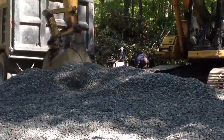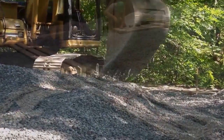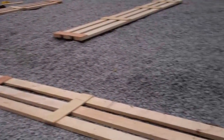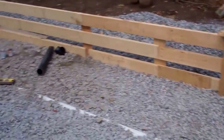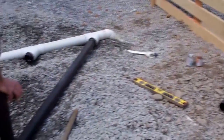Next came a layer of clean crushed stone. It's going to be in here that we're laying down all of our plumbing infrastructure. We then built forms and raised them — you can also do this by driving stakes in the ground and building up to your final level; we just thought this might be a little bit easier for disassembly. With a slab on grade, there's no basement where you're going to be doing your plumbing afterwards, so it needs to be laid out at the beginning and then it gets set right into the concrete slab floor.